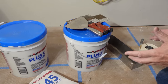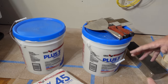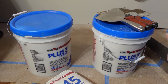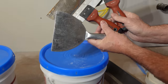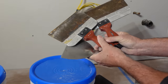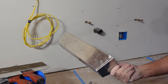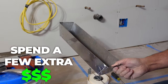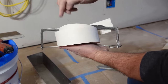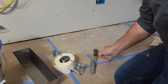Let's come on down here to the floor and let's show you our materials and equipment. You don't need that much. I have two different types of compound — a setting type and a pre-mix type. I just used three knives: a six-inch one that's all stainless steel, and an eight and a twelve. I've got a stainless steel pan — you can buy the plastic ones, but just spend a few more dollars and get the stainless steel. We're using paper tape, and I've got a dispenser. I like using that to free up my hands. I've also got a utility knife and a screwdriver.